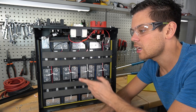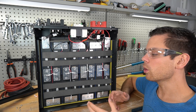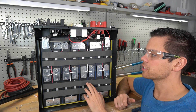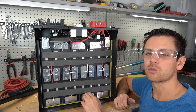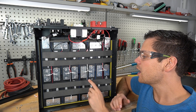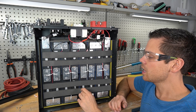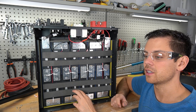With SOK you can swap out one cell or all the cells. One battery company told me they prefer welded terminals because for warranty issues you can ship the pack back and they send a brand new battery. On most lithium iron phosphate batteries, even cheap ones, shorted cells occur maybe one in a thousand — with high quality cells it's more like one in ten thousand, so it's not something to be really worried about. Also welded terminals have lower resistance than a bolt.